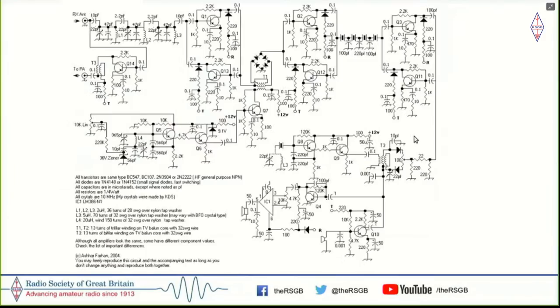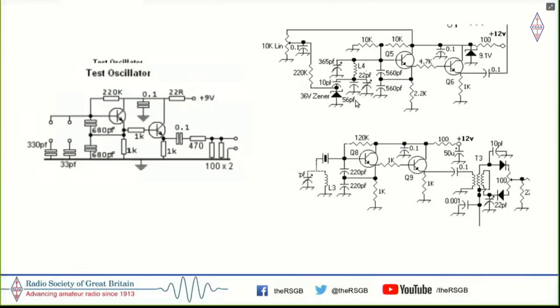So if you again go back to the BITX, it used the same circuit blocks all over. And here, if you see this amplifier, it is still the same micro R1 amplifier which I had started with in the direct conversion radio. So really, the only circuit which was mine was this mic amplifier. The rest were all blocks which I had earlier encountered in other people's designs.